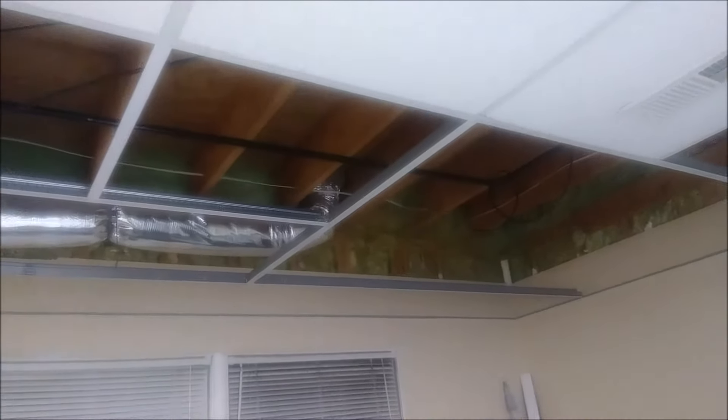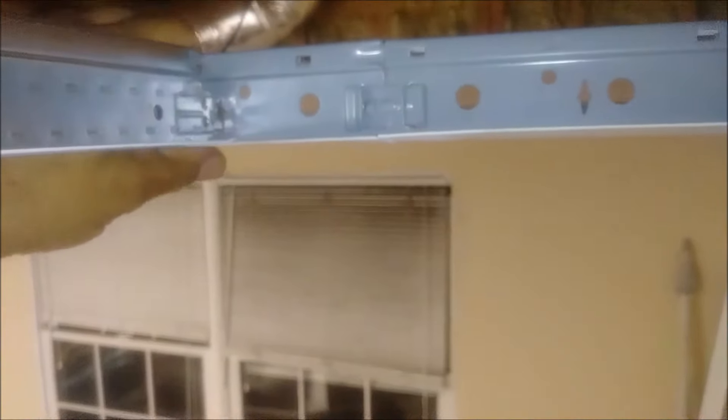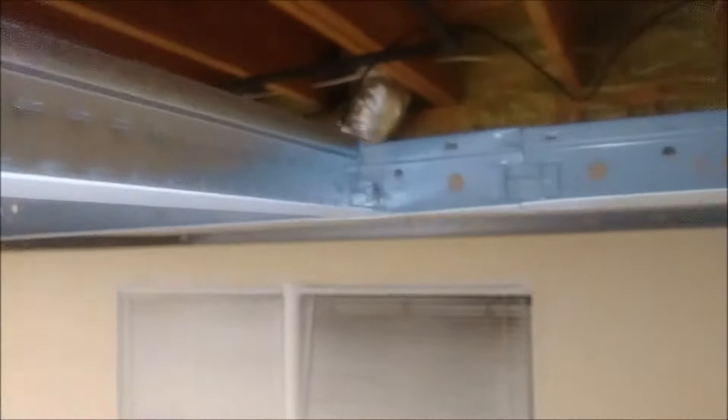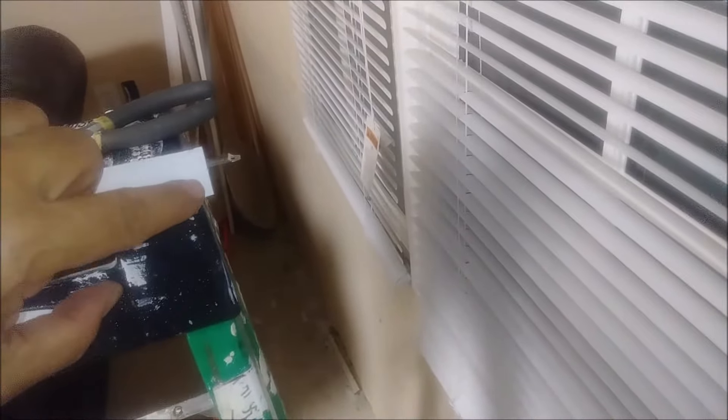It's very easy to insert the cross-T — you just put it in the diamond hole and press it. You hear the click and it's done. If you look at the cross-T, it goes flat until a certain point and then goes into a curve. That curve goes inside the panel of the other cross-T, so when connected you don't see it anymore — it looks perfect.